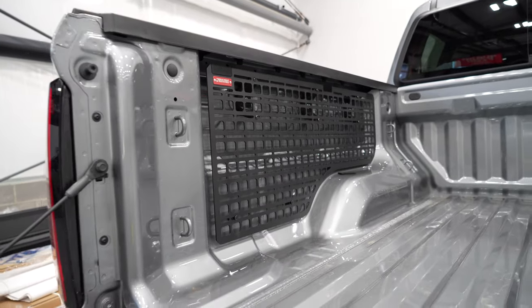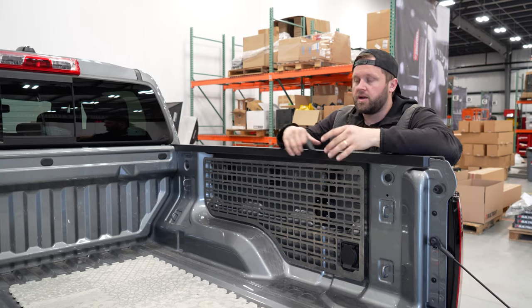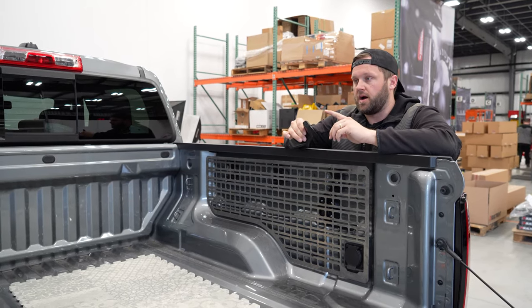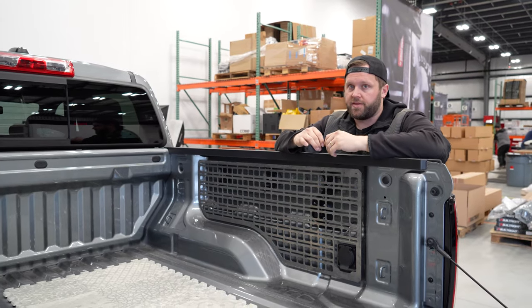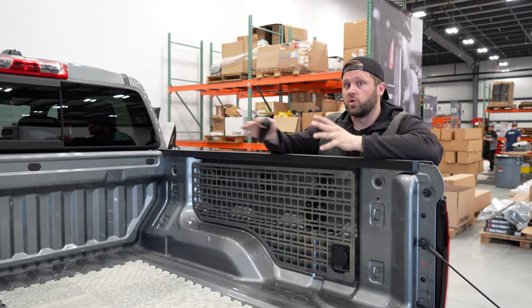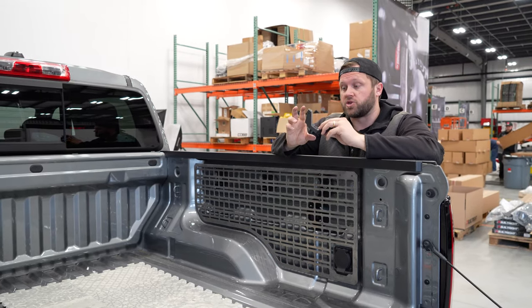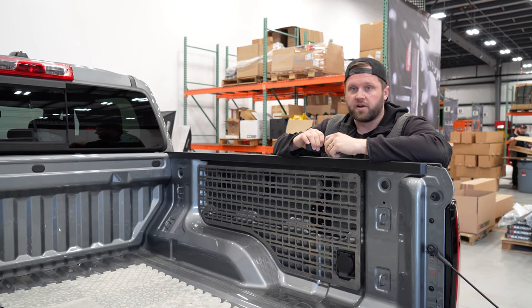All right, so here's how we're ending the week with the Colorado project. The bedside MOLLE racks, obviously, are what we've been working on. We've made a couple more revisions to the brackets. We need to work on manufacturability, understand what's possible there, and then probably prototype something that is even closer to a production-level part. And then we'll run some FEA to make sure that from a strength perspective these are not going to be an issue. They shouldn't be, but we'll verify that.